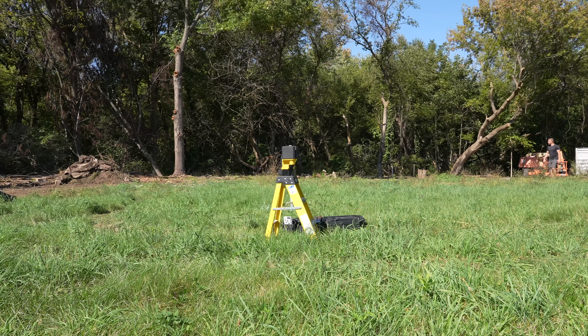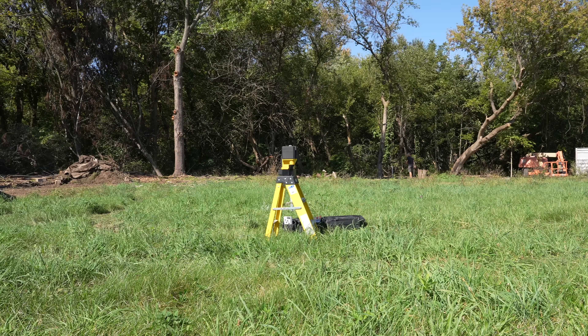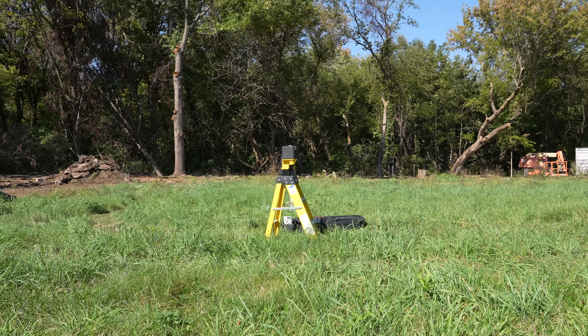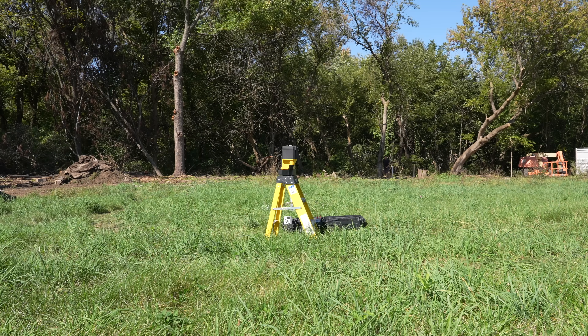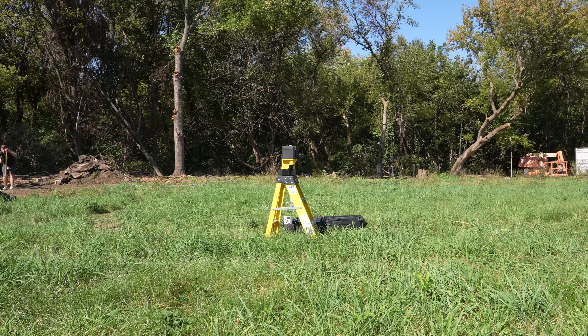It's the back that I'm really worried about. I'm pretty sure this is the lowest point right here. 53 and three quarters — you know, that's not as bad as I thought. It's less than two feet of fall. So that only means two feet of backfill right here. That ain't too bad. I wonder what this corner is — about 45 and a half.